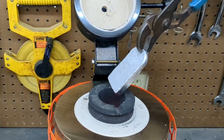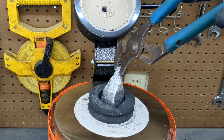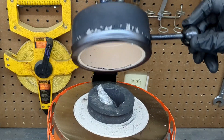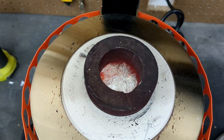Now it's time to check to see if that ingot was melted, and it is — but I don't have quite enough for the part that I am casting today, so I'm going to add a few more little pieces of aluminum to the furnace, trying to do it gently so I don't cause a splash. Checking back about 10 minutes later and the metal is now fully molten and ready to pour.